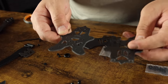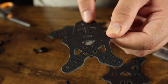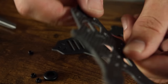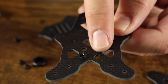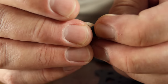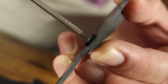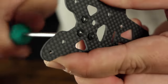The bottom plate and mid plate look similar. You can tell them apart because the cam plates go on the bottom plate, which also has the 20x20 stack mount for the VTX. The mid plate is where we put the press nuts — there's a top and bottom side, identifiable by the countersunk holes on the bottom. The press nuts go in on top, in the four larger-size holes. To install them: use a cup washer and the smallest Torx hardware, come in from the bottom through the back side, torque it down until it's seated on the carbon, then back it out.